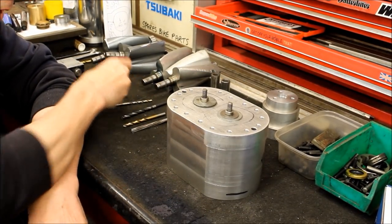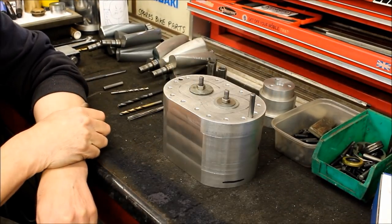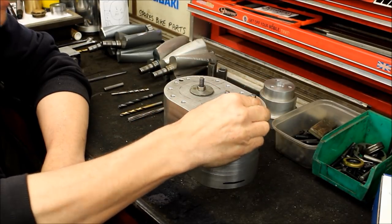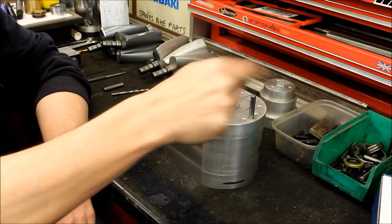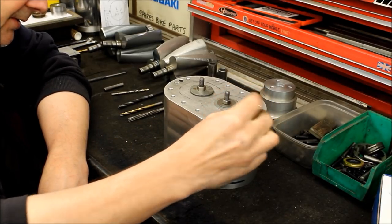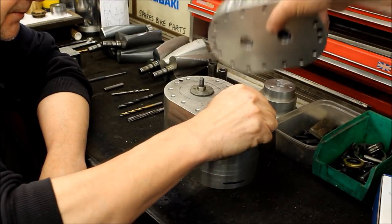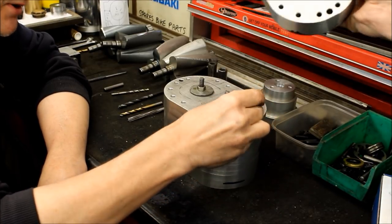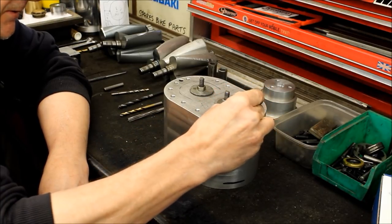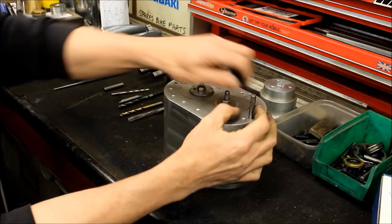What we can do is just drill it - we have a 7.8 drill and we can go in with that, and then the reamer to finish the holes off. Because they're not going to be threaded - it's a nice tap fit dowel. So it'll go into the case. And they're just a template to get all the holes lined up, because they have to be spot on, otherwise the rotors won't work together.